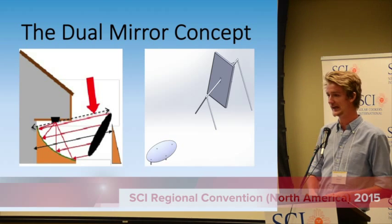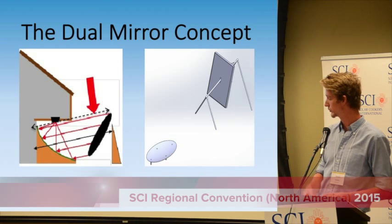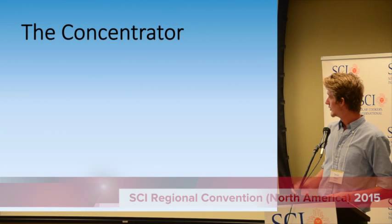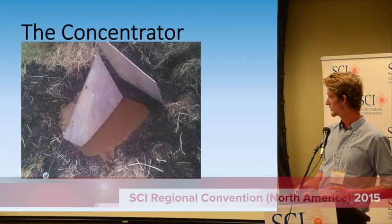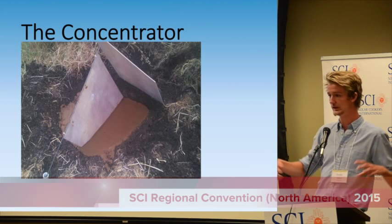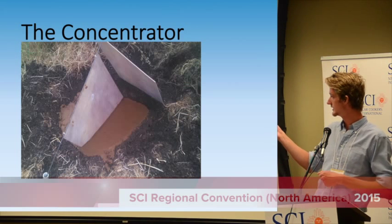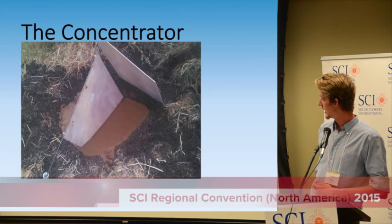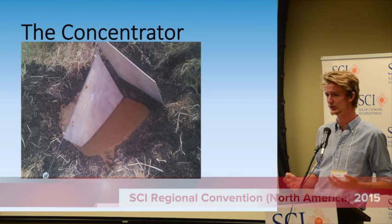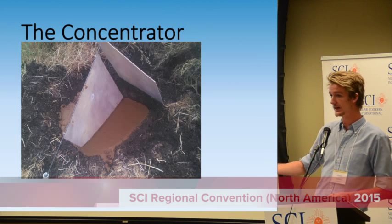This was our first concept, from about February. It's a little rough, but gives you an idea of the overall shape. For the concentrator, we tried a parabolic sweep: you cut a parabola from plywood, mount it on a simple rod, and sweep out a parabolic shape in the ground. We dug a hole, used a mud-like material as pseudo-concrete to make a mold, then laid wooden lath in the ground and let it sit for about a week.